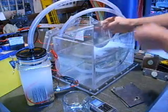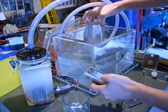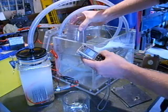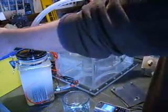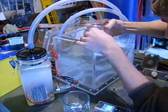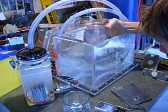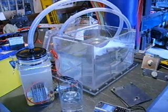That's bubbling out the hose now. I'm going to run that for a minute and see what we get. Starting now. Okay, we're down to the 5 second mark. Turn it off. Look at our watermark — it is sitting right between 50 millilitres and 100 millilitres, just over half way. That's right on 80 millilitres. So, 80 millilitres at 3 amps for this cell. I'm going to write that down, and then add a bit more electrolyte and test it again.